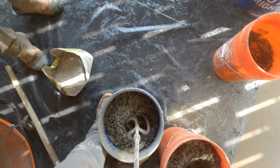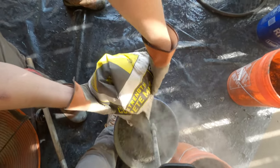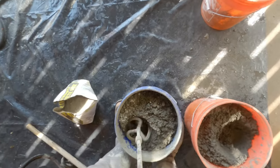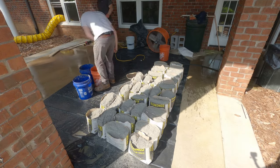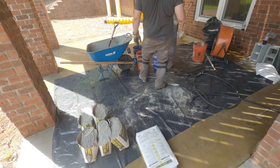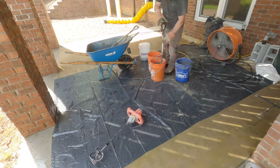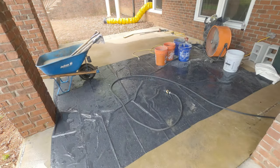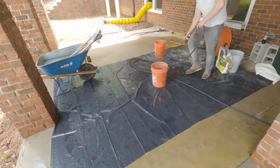You're watching us use a mixer. This is a handheld Ruby thinset mixer and it just works — it's got two speeds and even on low it has a tremendous amount of power. We needed a real low-slump mix for going up underneath that existing footing, dry enough that we could pack it up underneath there with a 2x4 and it wouldn't run out. The mixer is the way to go — if you don't have a portable mixer you'd be improvising with a wheelbarrow, shovels, and a hoe, and that would just kill you.